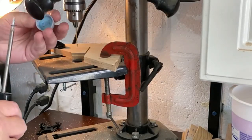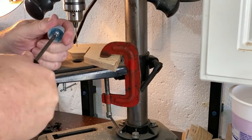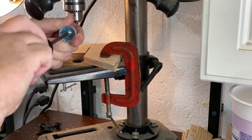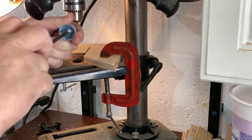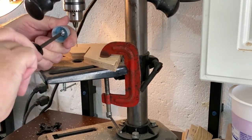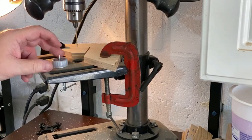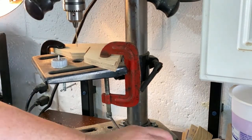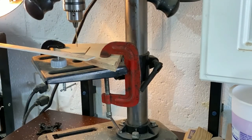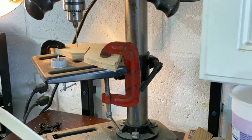Now let's take our screw, put it into the pilot hole from the bottom. The reason I chose these screws is they have a flange washer on them already, to help secure it to the plastic without pulling through. So we tighten it up. And there we go. So if we ever need to set a piece on it for painting, spray painting, finishing, we can use it on the back side of the material and it'll be barely noticeable.